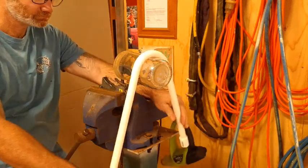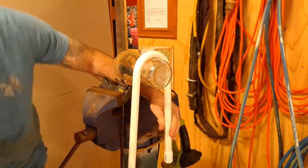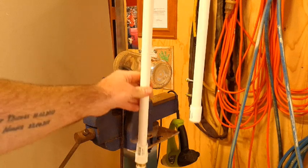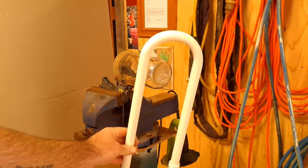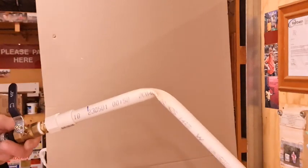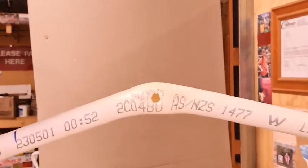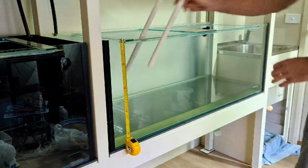I check it against the curve of the jar — I still need a little bit more heat, I've got a kink in one corner. So I heat a bit further along the pipe with very very low pressure air still in there. We bend it over and have a look — beautiful, no kinks. We just hold it there till it cools. Look at that — there's the tap, no kinks at all, just like it came out of the shop. Out of interest I heated up a piece of scrap and gave it full air at about 80 to 100 psi to see what would happen — bang, it blew the sides straight out. So if you want to try this keep your air pressure below 20 psi.